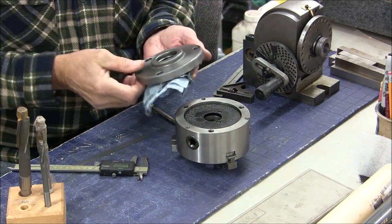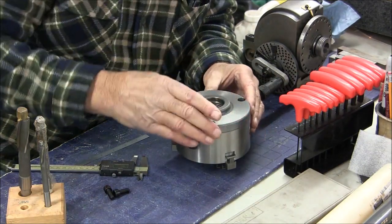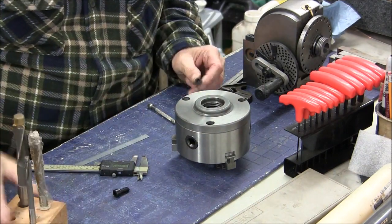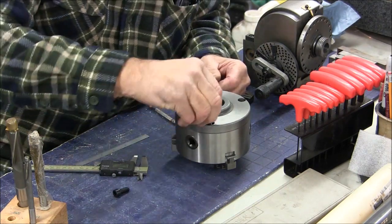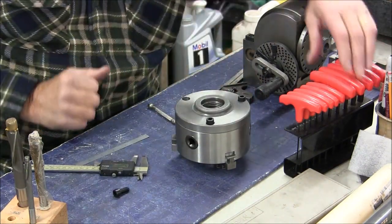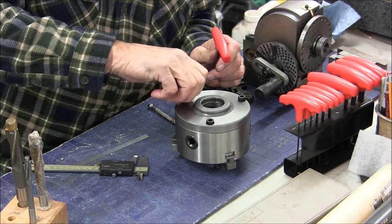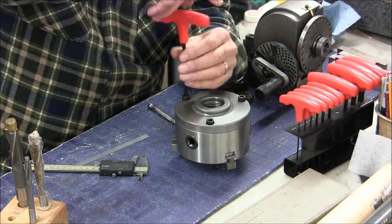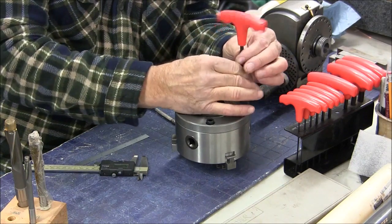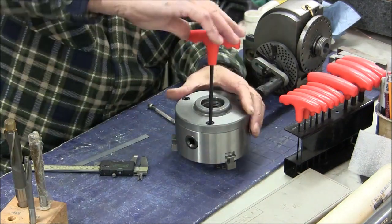So I guess we're ready for assembly. Let's see how this lines up. Now these are metric socket head cap screws, but I just used an imperial 5/16ths counter bore on that and drilled it just as though it was a 5/16ths socket head cap screw and I think that will work out just fine. Everything seems to line up well. I countersunk them about a 32nd of an inch below the surface — it's not necessary to do any more than that.